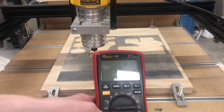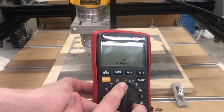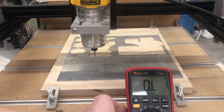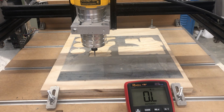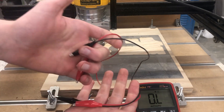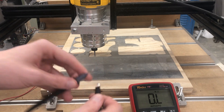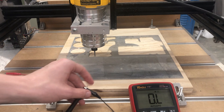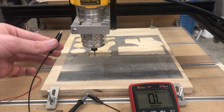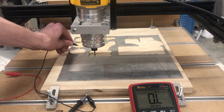What you can do is just pull out your handy dandy multimeter and turn it on and switch it to ohms so we're measuring resistance. You can see it says OL — that's overload, meaning nothing is connected and the resistance is too high. I'll set it down so you can see the reading. I've got my two probes and I'm going to use a couple of alligator clips to connect them. I'll take the ground probe and clip it to my piece.